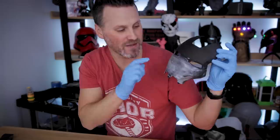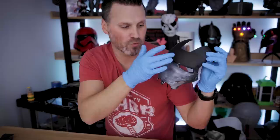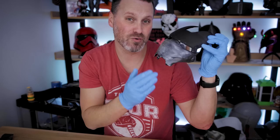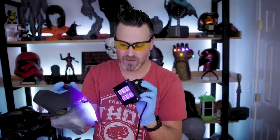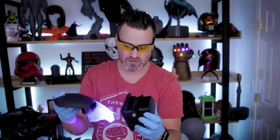Here is the updated Iron Man face plate — I haven't cured this yet. I've just used my fingers to smooth on this resin talcum powder mix on the lower half of the face plate. I'm purposely leaving the top half not finished because there are a few layer skips at the top that I'd like to have sanded smooth or filled in, and I think it'll be a nice contrast. I did also go over with my finger over the entire bottom half, and I didn't use any of the resin smoothing like I showed in the previous video. This might even be a better option than painting on resin for something as flat and smooth as this. So I've got my UV light and protective glasses on, and I'm just going to flash this on here. It should cure and firm up really quickly — I'll let it cure for about a minute or two.